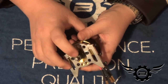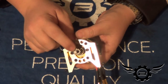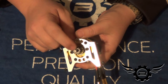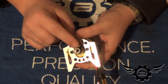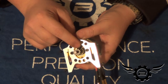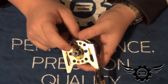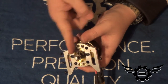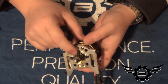This is very important: this pinion has a ridge on it that is designed to grab the inner bearing race on the pinion support bearing. If you don't actually allow the pinion to rest on the support bearing and then tighten the set screw, you're defeating the purpose of having the pinion support bearing. The pinion support bearing is there to keep the downward force created by the helical gear from pulling the shaft out of the can.